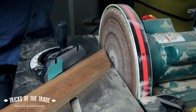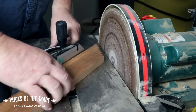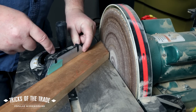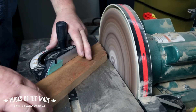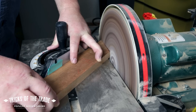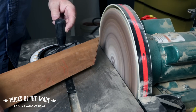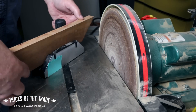If you need a few pieces, put them on there and you're ready to go. It's tricky in that you need to hold your pressure to keep it tight on the opposite side and let these post-it notes push out on this side. Let's watch it work. Towing in at the back — it's exactly what I want. There you go. Post-it notes are your fine adjustment.